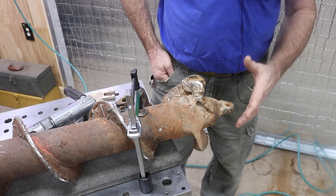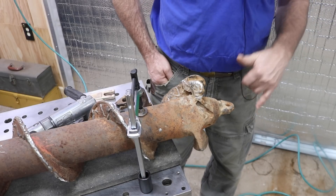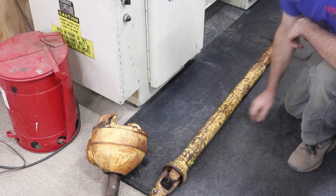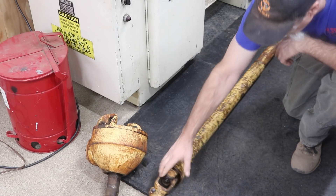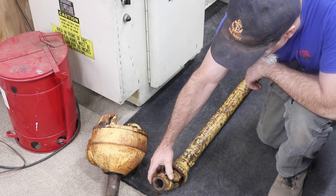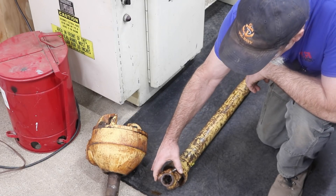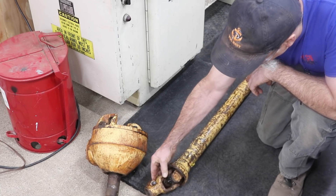We've already fixed up the driveline and checked out the gearbox. We've got some new teeth we're going to try to fit for this. This is the driveline for the auger. This end attaches and slips onto the spline of the tractor PTO output. Now this is a class one, three-point hitch type setup. This pin was all frozen and the U-joint was fairly stiff, but we greased it and it feels really good.